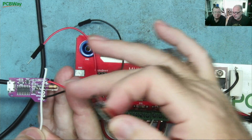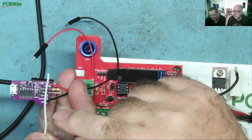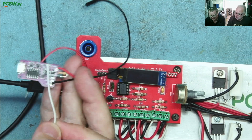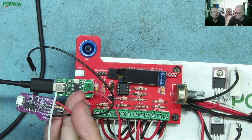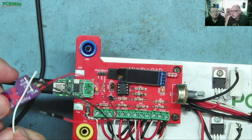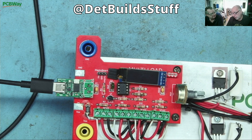These are leftovers I had to find for a different project that didn't work out, but I could reuse the CH340. Is there a project to build this? With this board, no. I tried — I have some projects going where I need to program an ESP8266 and I have a separate board for that; I don't want this logic on the same board. Normally, just to show you, you get pogo pins down here — you simply hold it down while programming and flash the thing. You only need to do this once when you have OTA on there. This takes only seconds — you just press it down. If you want to see more of this, let me know on Detlef's channel or here — he reads everywhere.